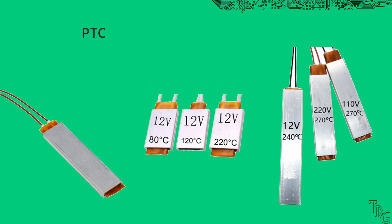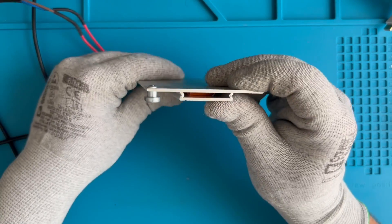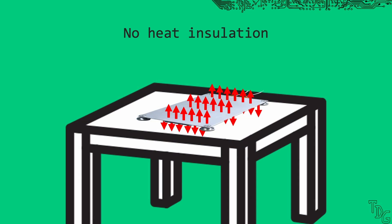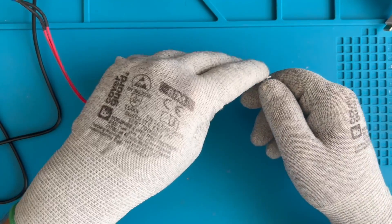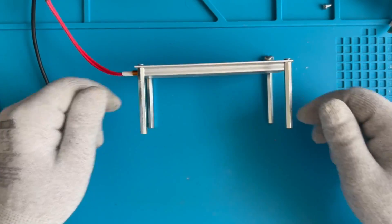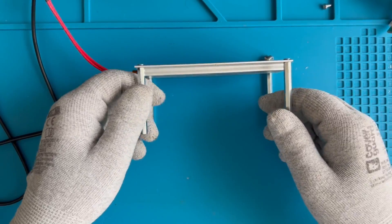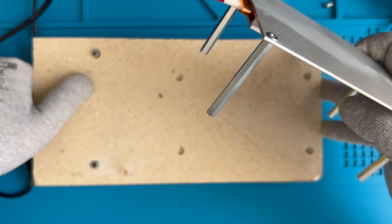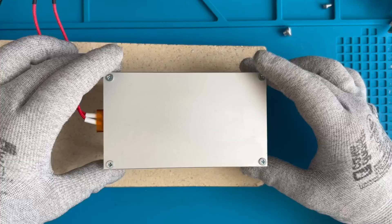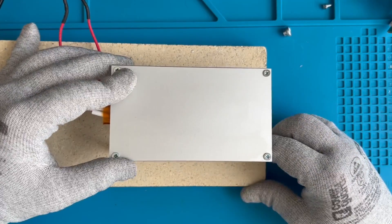It does its job, and that counts. The heating element is locked in place to our plate — it's aluminium in my case, which conducts heat really well. But heat gets radiated to the bottom too, and we can't really prevent it. If you just put it on a desk, it will fry everything under itself. They added some standoffs, but that's not enough. Longer standoffs could be a solution, but we really need some insulation. I used a piece of fire brick for insulation during soldering — it works really well. I drilled 4 holes and added some proper standoffs, so heat insulation is done.